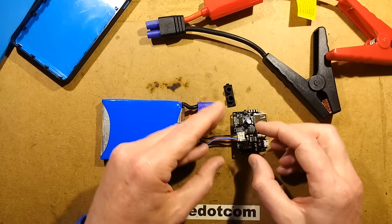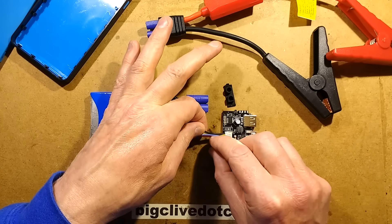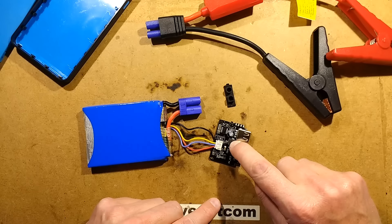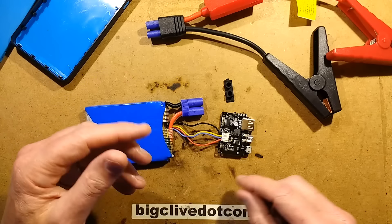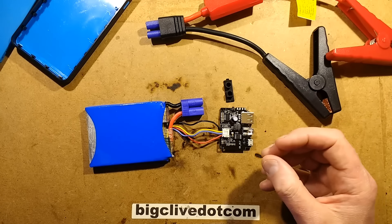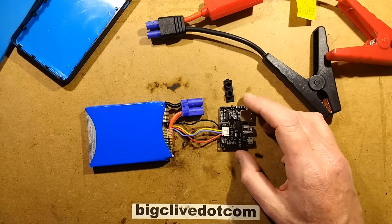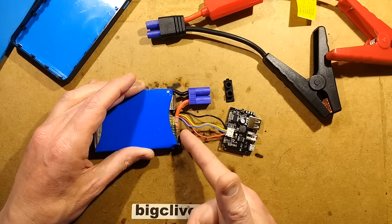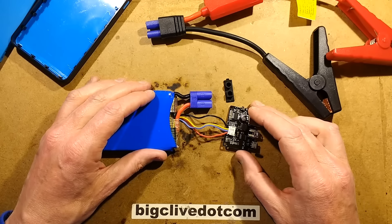On testing, when I plug the 5V in, current flows in both the red and black leads and the voltage is way up at about 12V, and this inductor gets warm. So I think it's using this inductor to step the voltage up to actually charge all the cells at once. I guess the DW01 chips are just acting as a sort of discrete balancing circuit, which is interesting since you'd think they'd just use a balancing chip like in standard lithium protector packs, especially since it's not carrying significant current. All the current coming out appears to come straight from the tabs of the batteries.